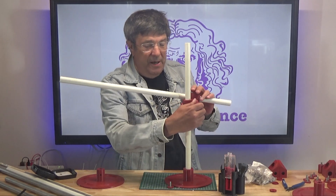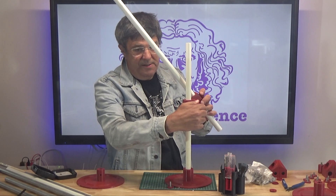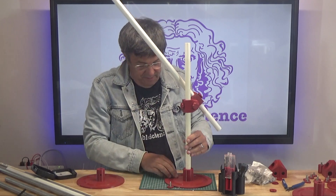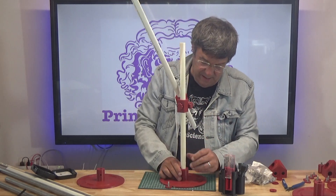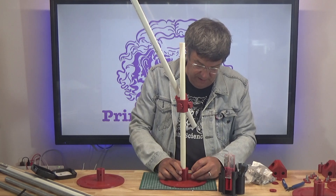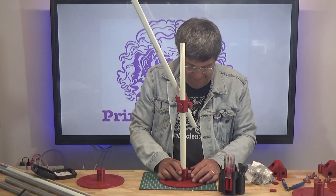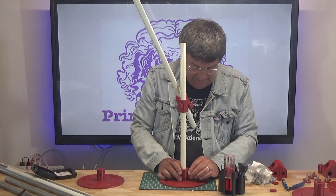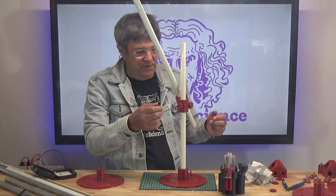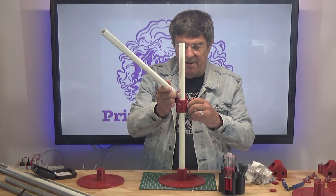To prevent this from spinning, take the longer three-quarter-inch bolt — you might get away with a half-inch, but I just use the three-quarter just in case. And there you have it. That's great for hooking up things for jigs and similar applications. I'll be using it in a few projects coming up where you'll probably see this design manifested.